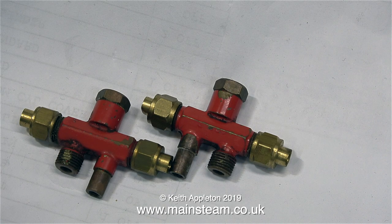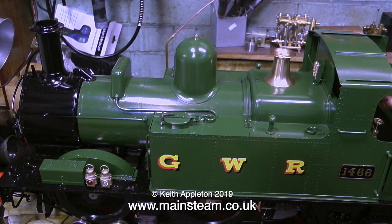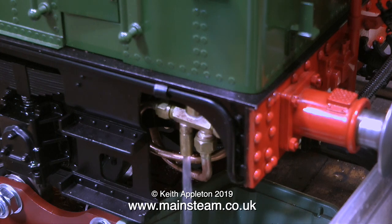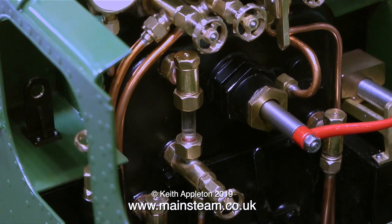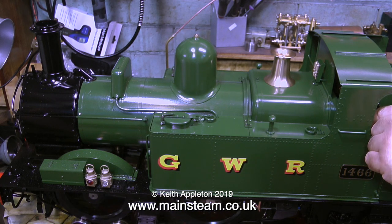A while back I made a video about working on a Chinese 14XX steam locomotive — here's a short extract showing one of the injectors. There's not really enough pressure at 25 pounds per square inch to make the injector work, but I'll give it a go anyway. I turn the water on first to cool the injector down, and as I open the steam valve the water from the overflow speeds up and then, to my surprise, it stops — which means the injector is feeding water into the boiler. Although it's not perfect and a little bit dribbly, I can clearly see the water level climbing up the gauge glass.